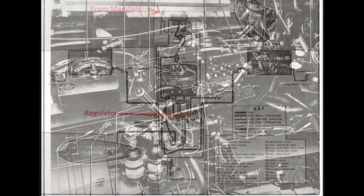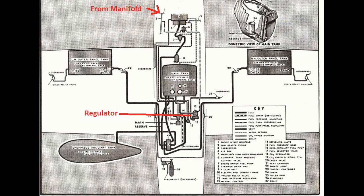The fuselage tank is pressurized by supercharger boost taken from the intake manifold and passed through a regulator. This ensures that fuel pressure doesn't drop at altitude due to the formation of vapors in the tank. However, if the tank is hit hard enough so it doesn't fully self-seal and starts to leak, this system will force fuel out of the tank at an accelerated rate. Of course, we don't want that. So, to minimize leakage in this case, the pilot can shut that system off.